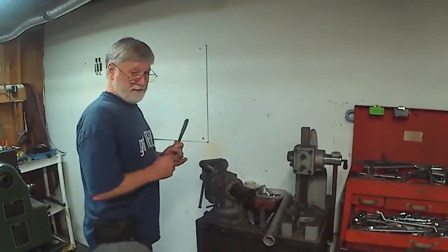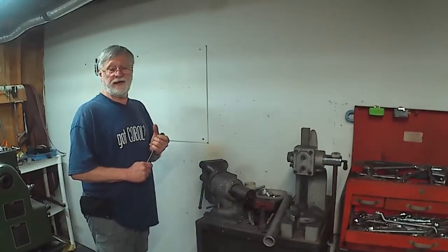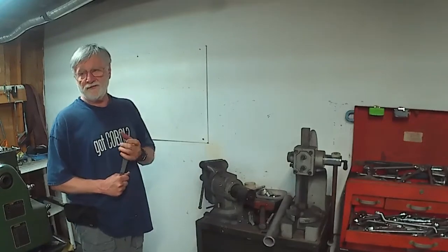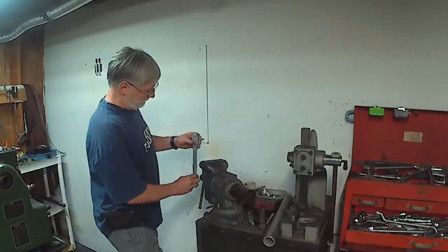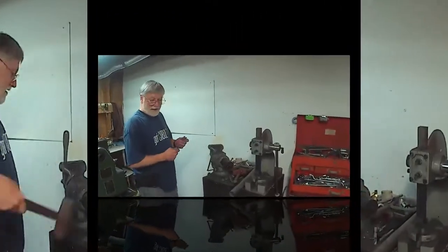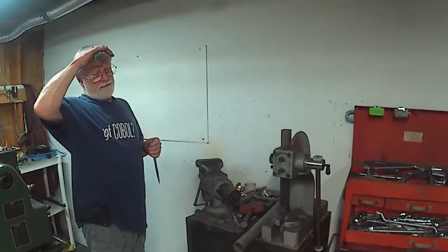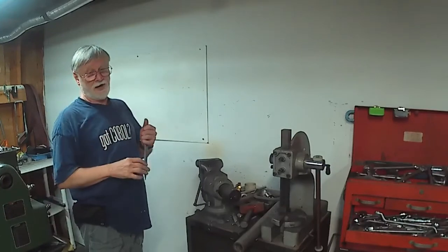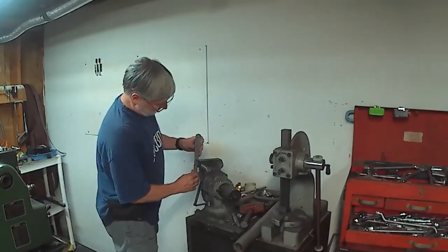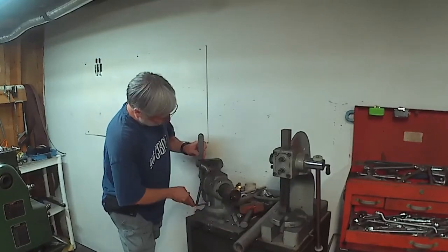The results of the second round of 10 hits on our knife: we went from 3.1 to 3.4 total deflection. After the second round, on the arrow, it went from 1.6 to 2.2 degrees of deflection.